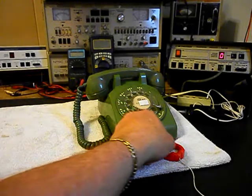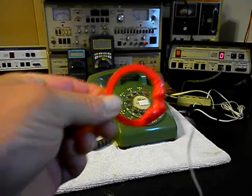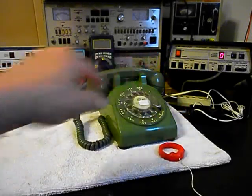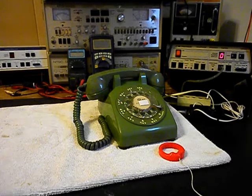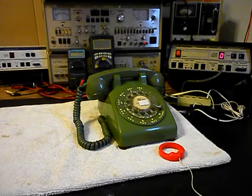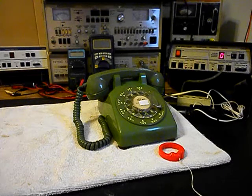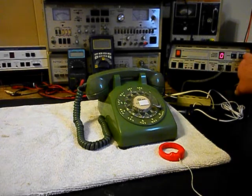Now, we also want to mention our amplified pickup. We use this in troubleshooting, repairing, and on our final checkouts. It's amplified so you can hear the audio from a receiver on our final checkout. We also have that amplifier backed by the video and I have a button on it where I can give dial tone or take it away at any time. So we want to ring this unit — we're going to use the analyzer, we're going to send a ring cycle, so we'll start that.